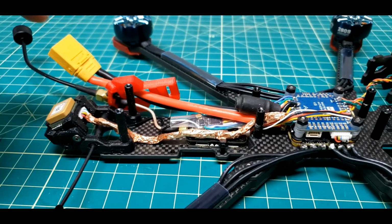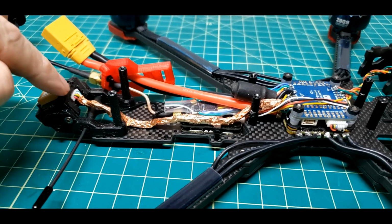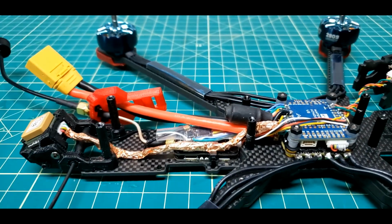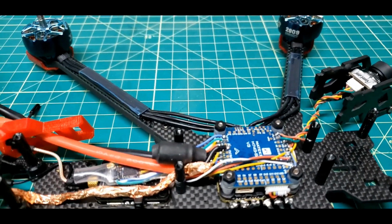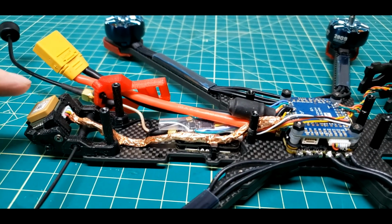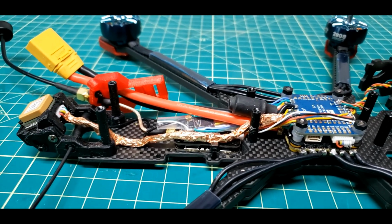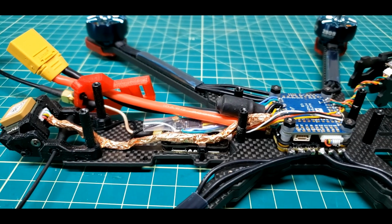Bucket of Bits and I have been talking about this for a week or so. So there's my wire coming out and running inside copper shielding, and the shielding is grounded. That's about the best you can do. I personally think the problem's more in interference getting into this unit than the wiring, but you know, you do everything you can and hopefully somewhere along the way you fix the problem.